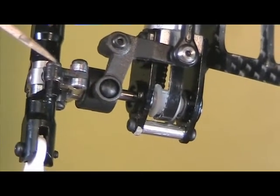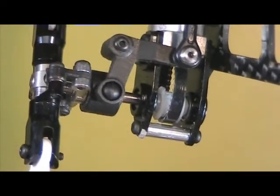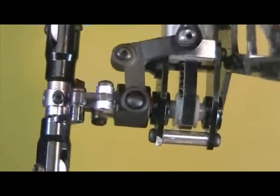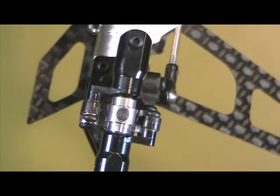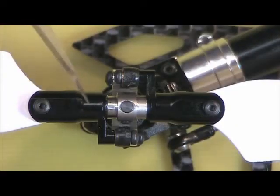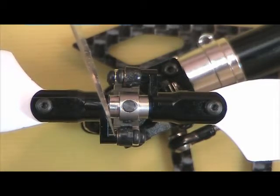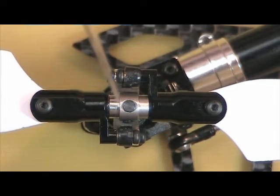The actual pitch arm screw loosened totally — it's backed out a couple turns, so this is now free as a bird. Looking at the angle we've got going on here with the face of those, here's what I think is going on: the thickness of the link right here on this face is too long, and it's making this be pushed in this direction. In other words, the blade grip is lagging the slider.